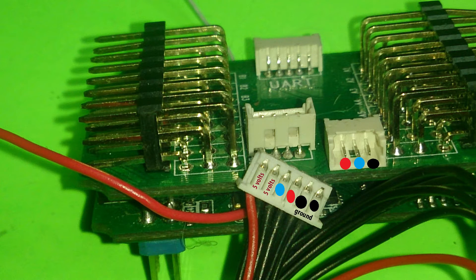The reason I'm only showing the end of the cable is because if you have a power module for an APM 2.6 or a Pixhawk, it doesn't matter how the other side is connected — some manufacturers might wire it differently. So I thought I would take that out of the equation to be less confusing, by only showing just the other end of the pins. It's pin-for-pin compatible, because it has to be able to connect to any APM 2.6 or Pixhawk.